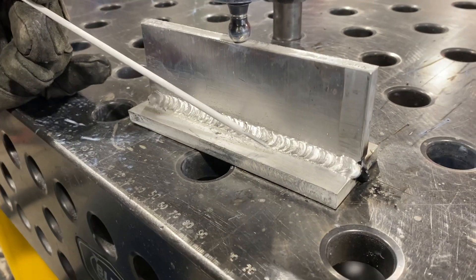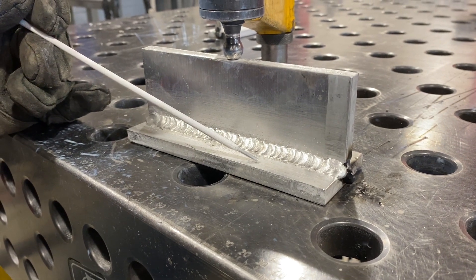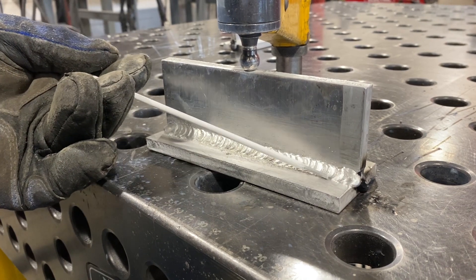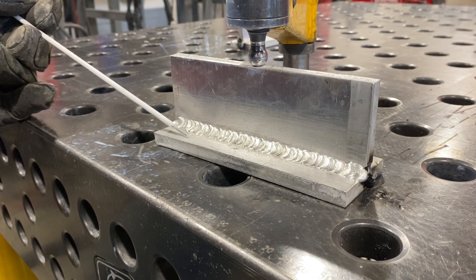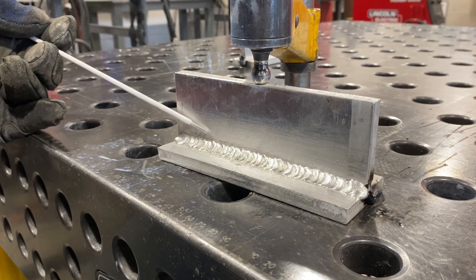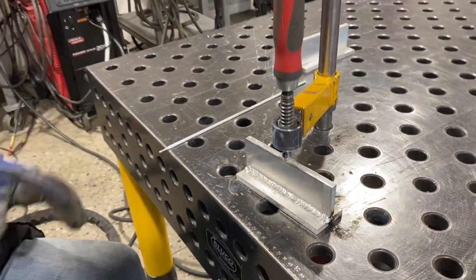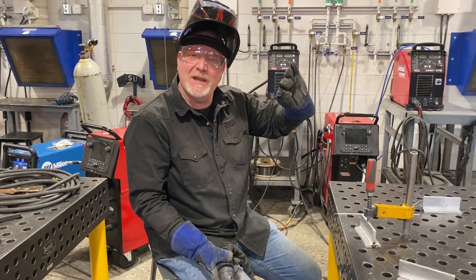This is the hard thing about horizontal fillet welds — getting them placed in the joint correctly. They always end up on the bottom because that's how gravity is pulling it. We want the toes of the weld, or the edges of the weld, to be fused into the base metal, and we want that weld sitting even in that joint. As we put another layer on, we have to make sure this one doesn't get too far down on the bottom plate, because if it's too far down, the top one's going to be too far down and your weld is not going to be sitting flat in the bottom of that joint.